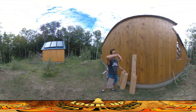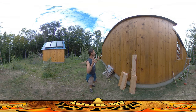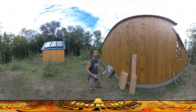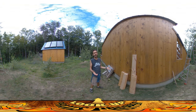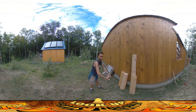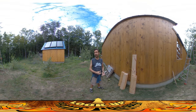These four boards here are going to be the outside boxes around them, and yeah, it's really coming together. The greenhouses are so much more comfortable now with the airflow going through. The one with the chickens in it doesn't smell at all anymore — it was kind of smelling like a chicken coop before for obvious reasons. It's such an improvement to get these vents in. Cool air comes in at the base, hot air goes out the top, and I'll be able to close these when we want to really keep all that hot air.